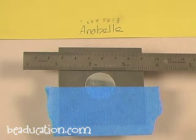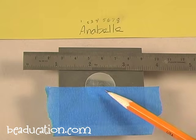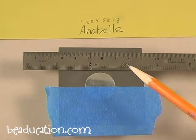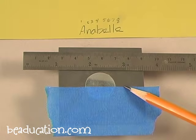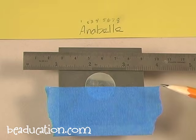All right, I'm almost ready to stamp, but here, you want to prep it, get it all ready so it's close to perfect. So what I've done here is I've got my blank. It's a sterling silver 24 gauge 7/8 inch circle, and I've taped it down to the bench block. I'm also using the top of the tape as my reference line, so it's a dual purpose piece of tape there.